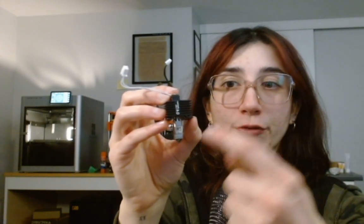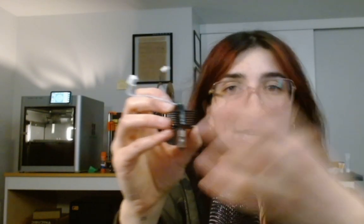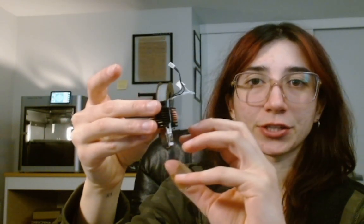That is also why I think this trick works so well. If I'm talking about a heat creep clog on the X1C hotend, that means filament is clogged from the nozzle all the way up to the top of the heatsink where filament enters. When I heat up my hotend, the main heat source from the ceramic cartridge is in that lower area and creeps upward. When clogged all the way up, I'm not reaching the required temperatures to fully melt material up there to do a cold pull or use the normal allen key trick. By drilling away some of that material, there's less that needs to be melted using the residual heat — so it's a lot easier to unclog.